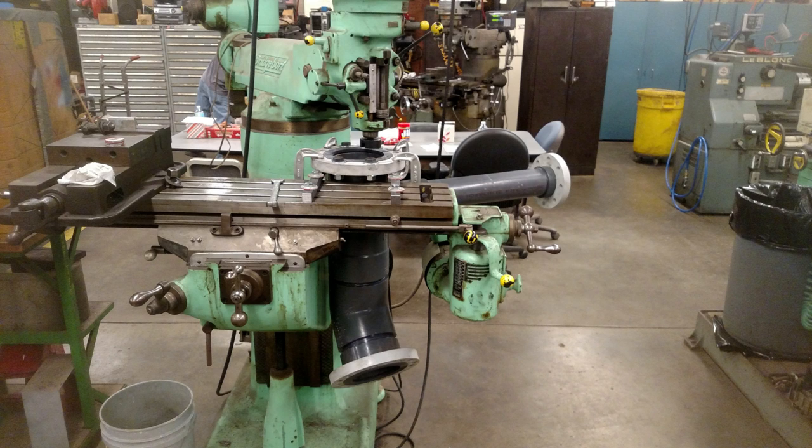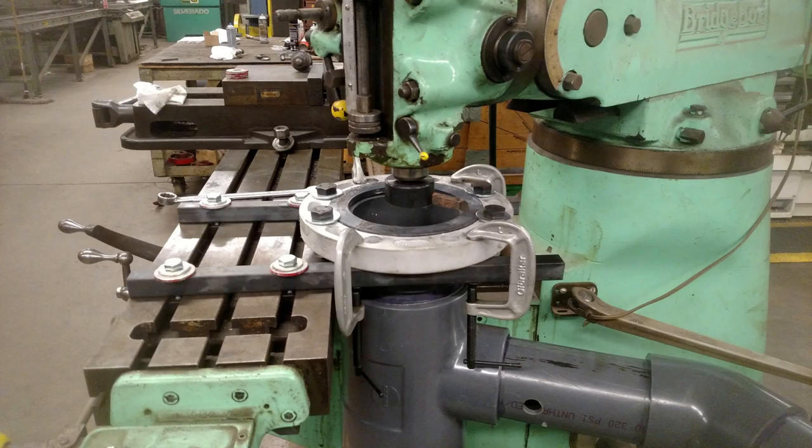Coming back to the first picture, I actually had to do this to both of the faces — the one that's set up there as well as the one below it at a 45 degree angle. That angle didn't cause any problems because it was just located on the bars so it was nice and flat. Beyond this it was actually just a straightforward milling operation. I used a fly cutter and just went straight across the face and got it all one level. It really wasn't all that weird besides the strange setup.